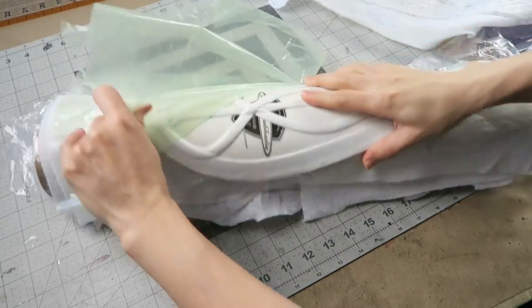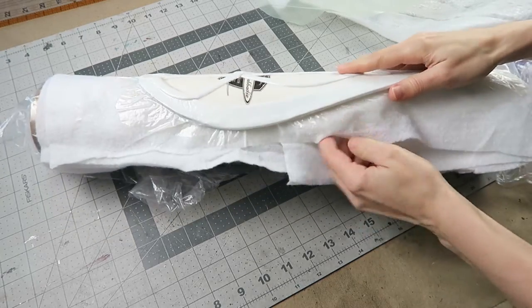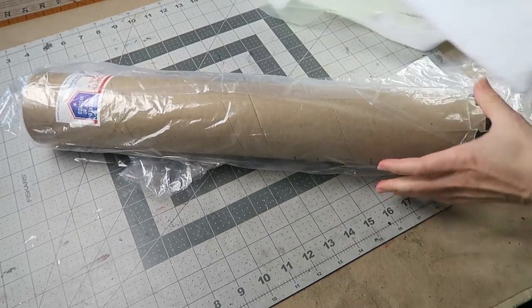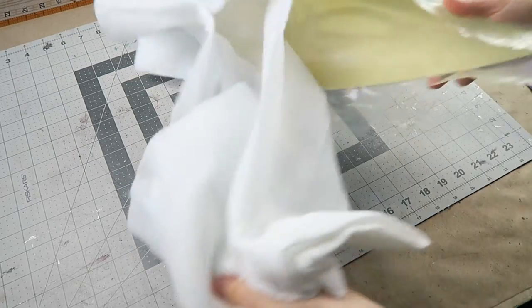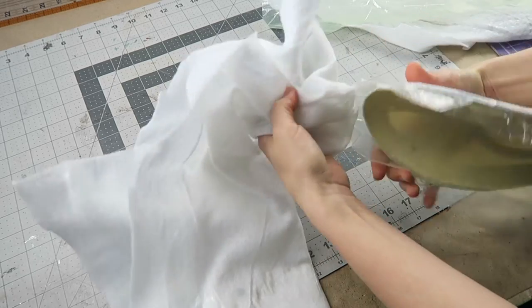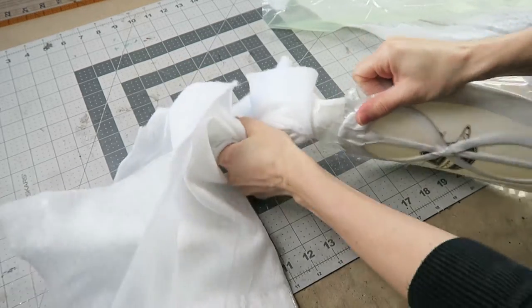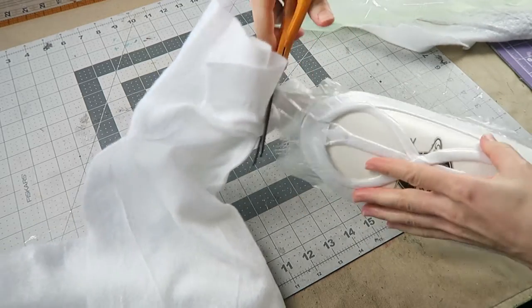So there are a few wrinkles. Probably, I'm thinking it's because I didn't glue down the fiberglass first. So I'm definitely going to use some spray adhesive on the full-size version so that the fiberglass isn't wanting to shift around while I'm getting the bags positioned. For that edge that I wasn't able to flip down, it's super easy just to trim off with scissors. It's just one layer of fiberglass, so it's not difficult at all to trim.